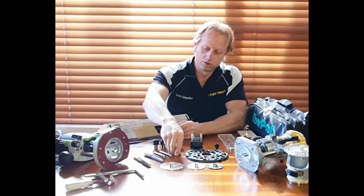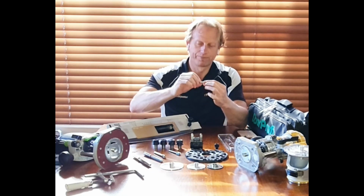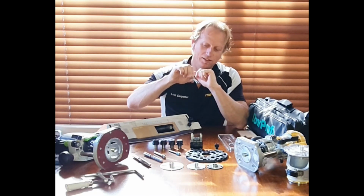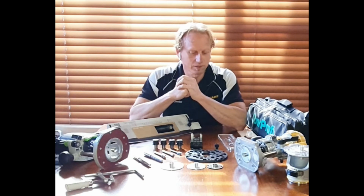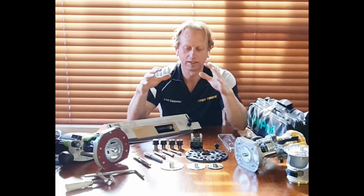I like to use cutters with a bigger shaft, 8mm, because I just think it's safer, especially when I'm trying to extend the reach of the cutter so I can plunge deeper. I don't want anything snapping on me. Nothing snapped on me before, but it just depends how good you are with the router. I don't push it to its absolute limit. I don't burn the things out. I just take it easy.